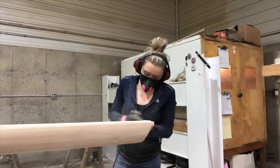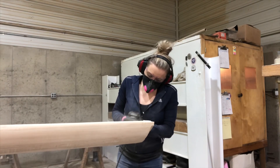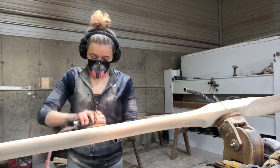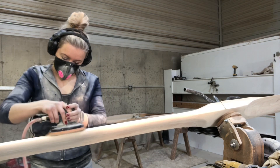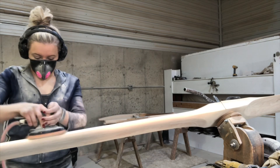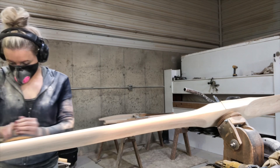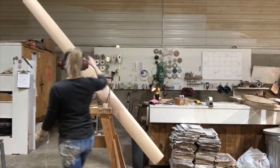It's a little bit scary to use at first because it takes the material off so fast, but that also gives you the opportunity to screw up really fast as well. After that I go back to my air sander — I use a Dynabrade because it's very light and air powered. I usually use 60 to 80 grit sandpaper on that, basically just taking out all the lines that the belt sander made. This can take maybe 30 minutes a blade.